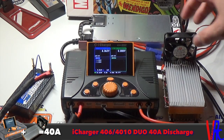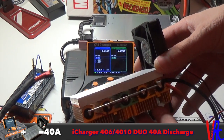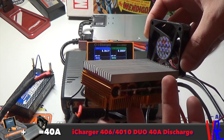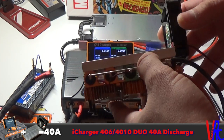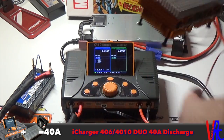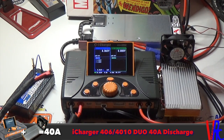The first thing you need is a resistor bank. This is one of the ones I make personally — I'll leave a link in the description below where you can find these. The cool thing about mine is I wire the fans to go directly to the power supply, so you're getting full voltage to them and they can run when the discharge bank is not being used, so you can cool them down better.